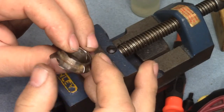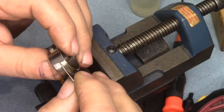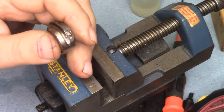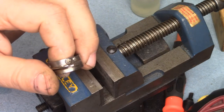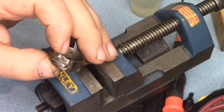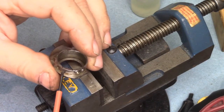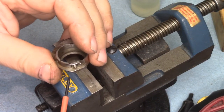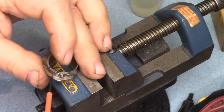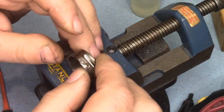For anyone who's worked on a Singer 99 or 66 with a nasty bobbin case like this — there's a lot of rust on this one. How do you get it apart, and more importantly, how do you get it back together again? There is a spring right here that the thread actually goes underneath, and this is the tension adjusting screw for that spring. So it's kind of important how you get these devices apart and back together.